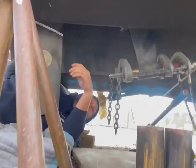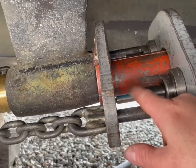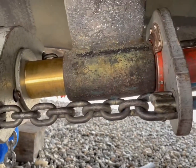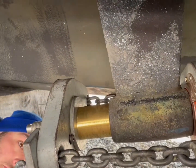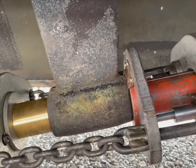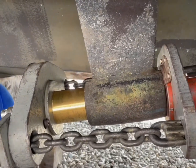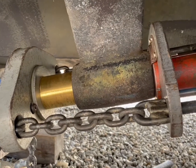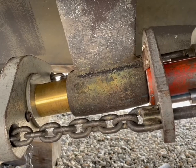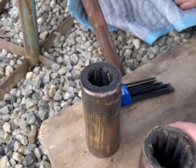We're maxed out on the cylinders — you can see we're about halfway in. On this next move we probably won't get the advantage of these little cylinders, so we'll only get about an inch and a half to two inches of movement from here. Going in is usually pretty easy — it's the coming-out process that's usually difficult. That's why we tell you to do them more often: three to five years, with six years being really the most you ever want to go. What we're looking for is dry rot — when you start to see dry rot, it is time to replace your bearing. Thanks for watching.